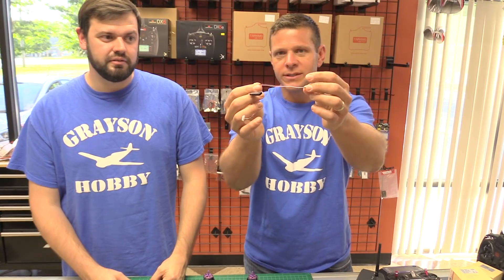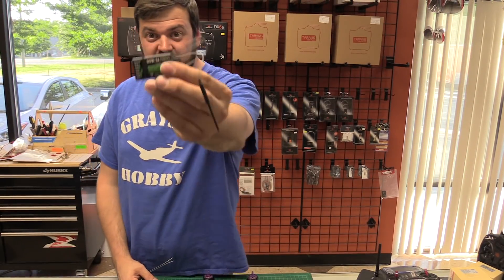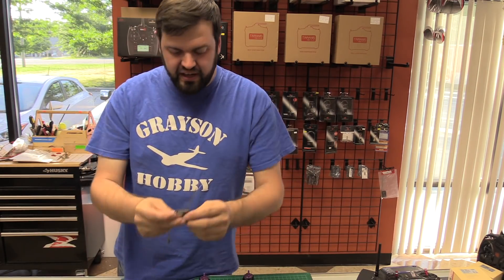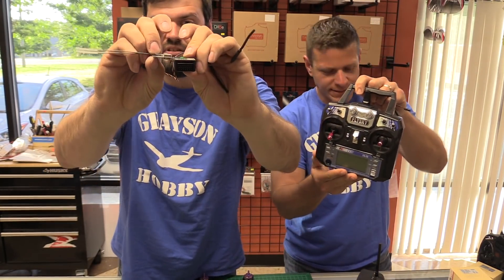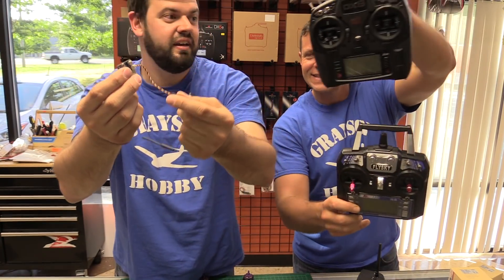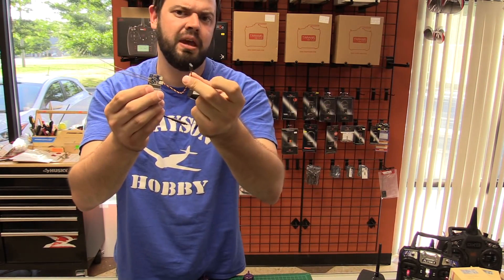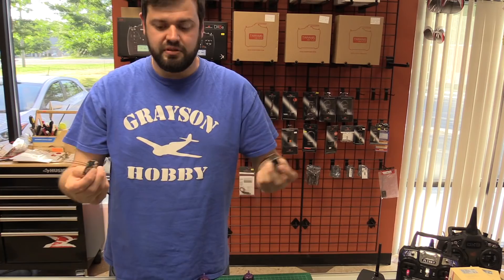Subscribe and comment below — what do you think about this video? Hit the bell button and stay tuned for our next video, which comes out every Thursday. Thanks a lot. A lot of guys are trying to ditch the stock receiver — it's a decent receiver but has bulky connectors, it's soldered in, and it's big. Quads are getting very small, so FlySky came out with the X6B: smaller, lower profile, thinner, no unnecessary pins since everybody's running iBus or PPM. The adapter solves the connection problem since FlySky included two of the same cable type instead of one of each.